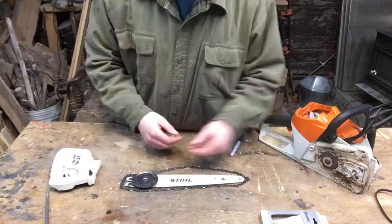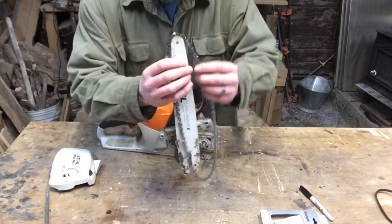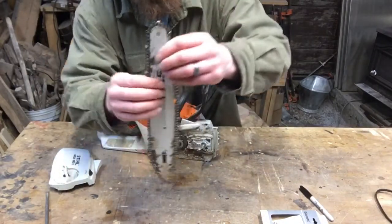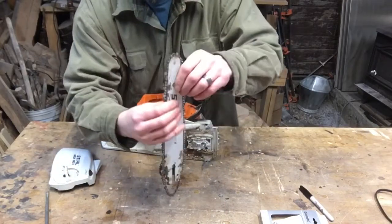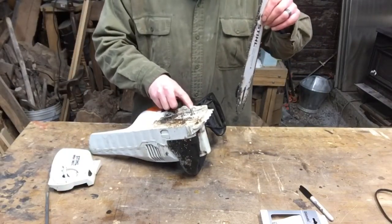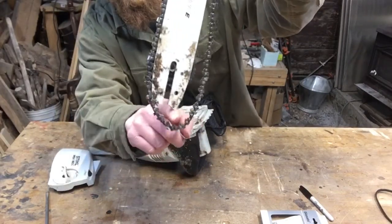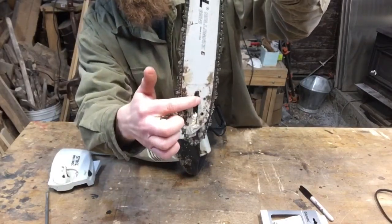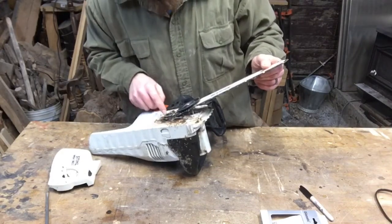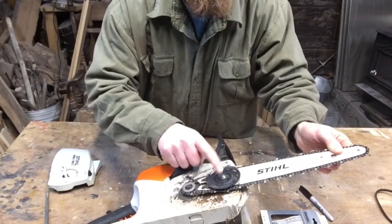Now look at your drawing. If you have to, just draw it up and lay it right here in front of you. Teeth need to be facing the back of the bar — that's where the teeth are grooved in like this. You can see the sharp edge, and that should be on the bottom side of your bar. Alright, so I'm good — they're facing that way. This might be a little over-explained, but I grab the nose of the bar like so, get my chain down, and put it in the groove. It's going to slap around and probably not stay there, but it kind of sets you up. Put my saw on its side. You've got a bolt sticking out here and you've got these teeth here on the saw. Those teeth are going to go right in here on the saw and that bolt is going to go through this hole.